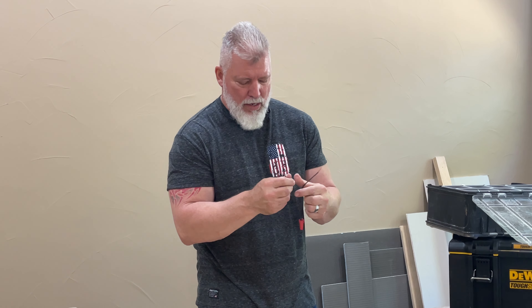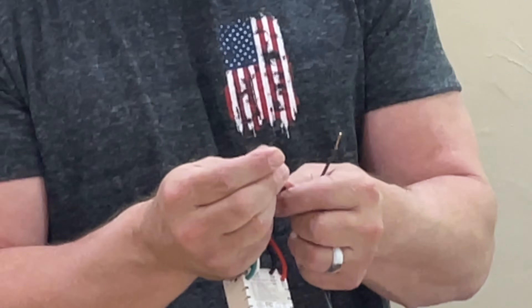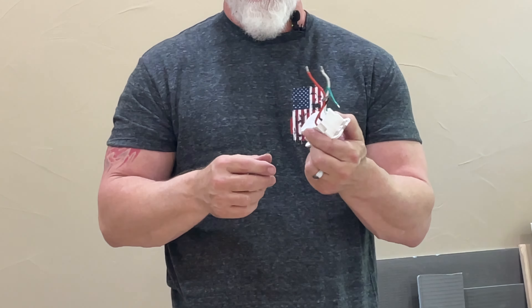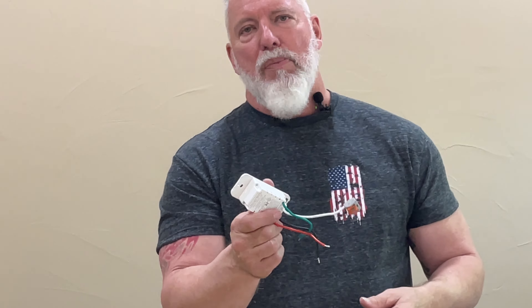One of the big problems with wire nuts is combining a solid wire with a stranded wire. When you wrap those around each other it's very hard to make a good connection that doesn't come loose. The Wago handles this easily. For example, this is a smart switch that's pre-wired, so it works extremely well with Wagos — you just take the Wago, put it in, and you're ready to make your next connection. It makes wiring up a smart switch very quick and very efficient.